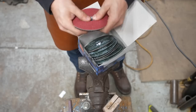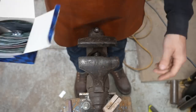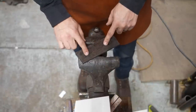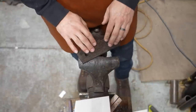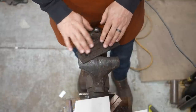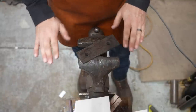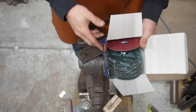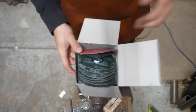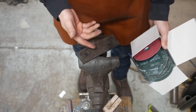What we're going to do today — to make this example quick and simple — is take this very pitted piece of three-eighths plate and use the grinding set to get it to basically a uniform finish, and then use the finishing set to essentially polish it. You can see how quickly we can run through these abrasives and get this thing looking nice, and you can imagine the different applications you could use this for.